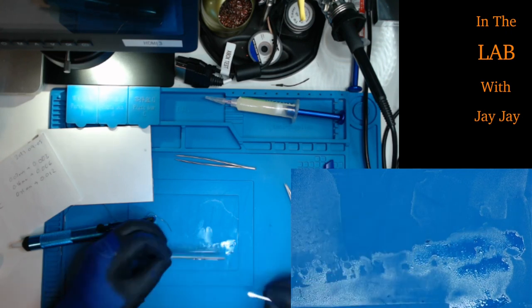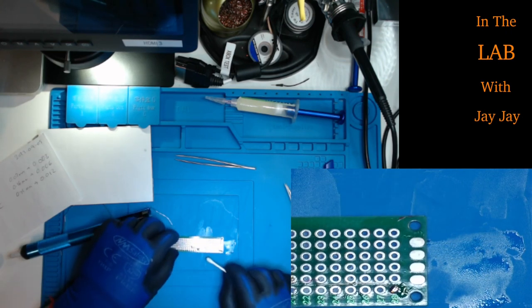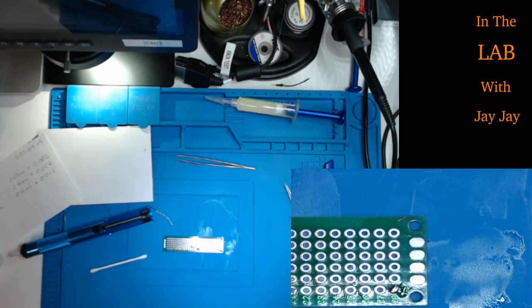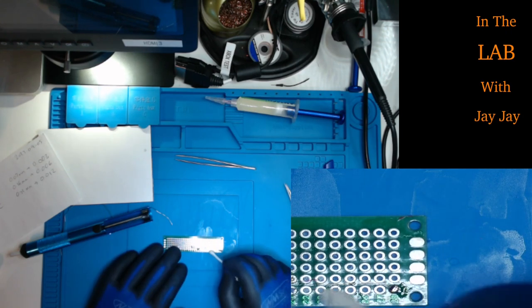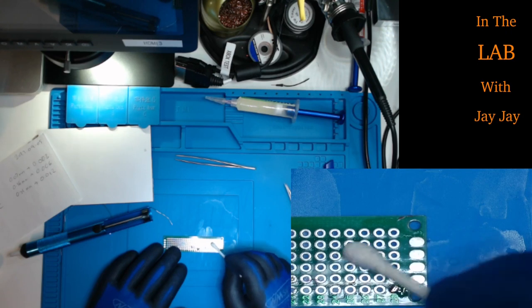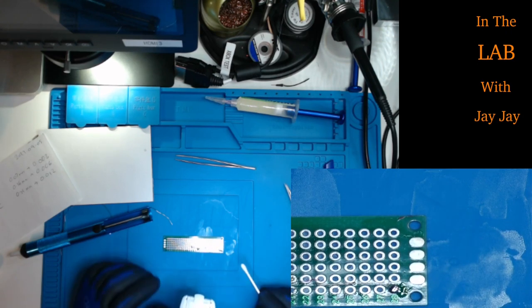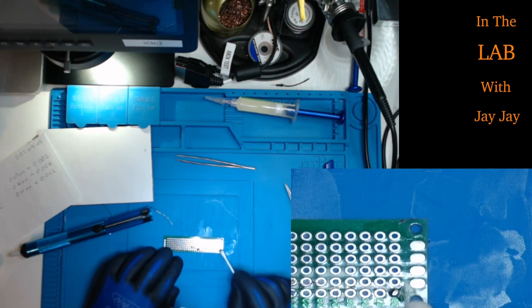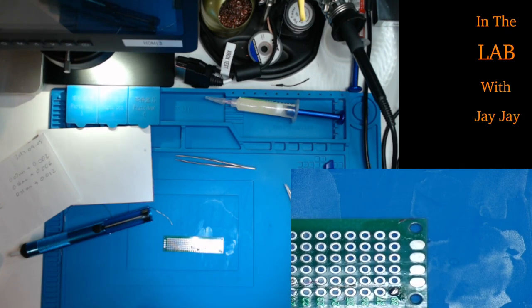So we've got all of our soldering done, and things look pretty good to me. We might have some bridges on there, it's not entirely clear. So let's beep him out and see how we go. Actually, I think I still need a bit more IPA. Let's hit him again.